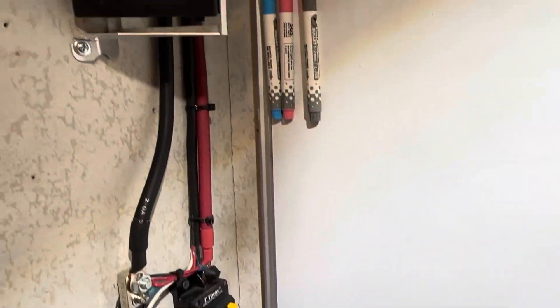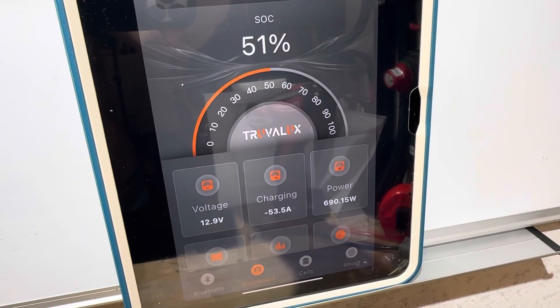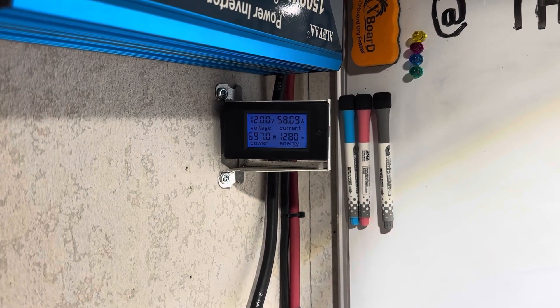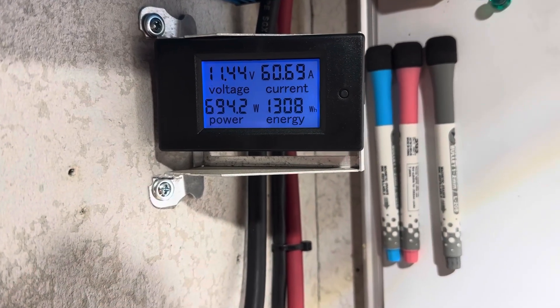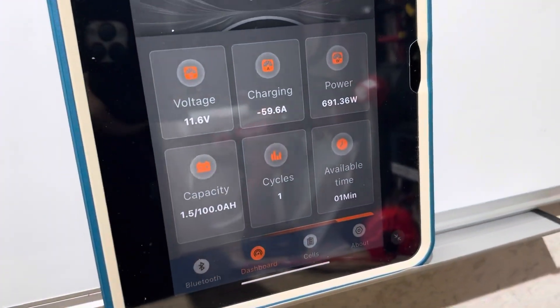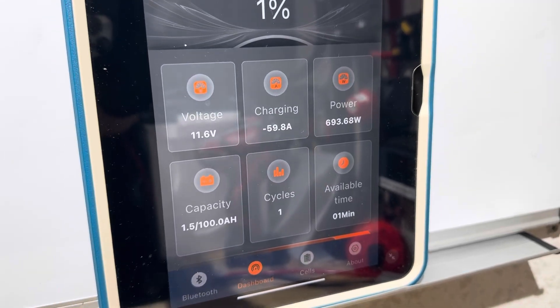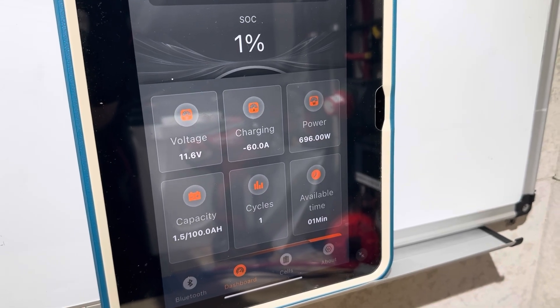About to cross the halfway capacity mark. There went 640 watt hours — I have a potential 1,280. So about halfway there, and the Bluetooth is showing 51% state of charge. About to reach the rated capacity on the Truvelux battery. There we went — rated 1,280 and 1,280 delivered as of right now. Bluetooth is showing 1% state of charge remaining. The app appears to have a little bug and doesn't track all the way down to zero, so we'll see what happens as I completely discharge the battery.